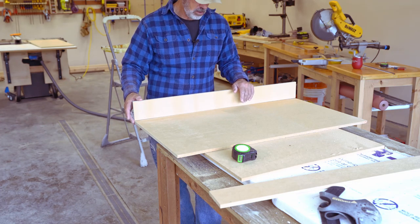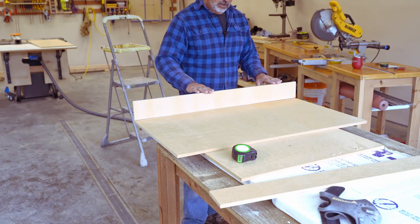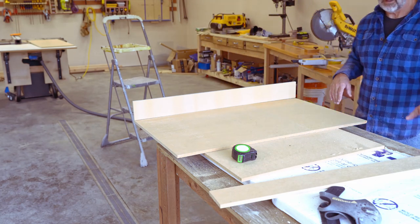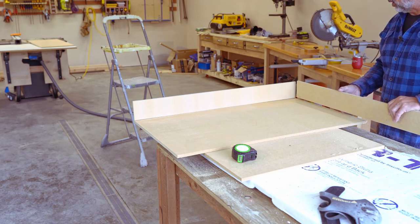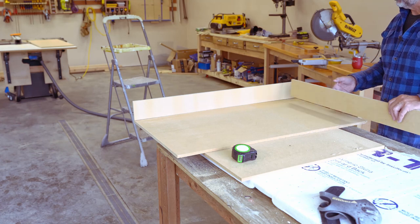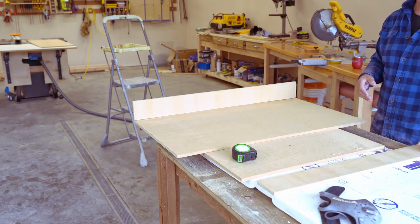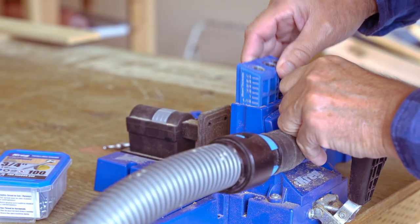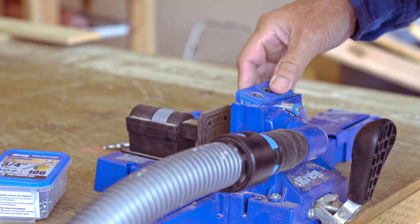So in order to get that box, it's going to be three sides. I'll use these off cuts — they seem to be about the perfect depth that I need. I need to cut three of these at twenty and a half inches, over at the miter saw. I'm going to get busy on that. Set up my pocket hole jig — I'm going all the way down to a half inch board thickness, that's how thick my MDF is. This is how you set your screw length. I'm going to bring the bit down onto the three quarter inch, and now you just set the collar to be flush.